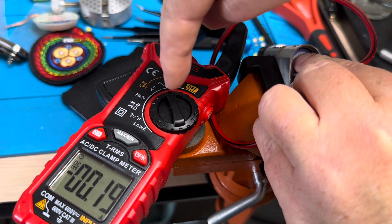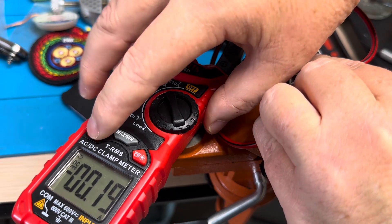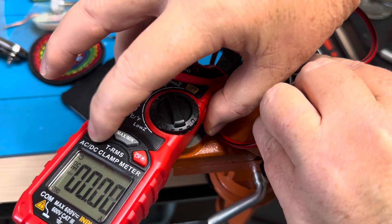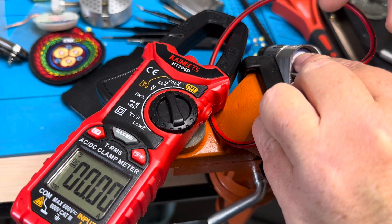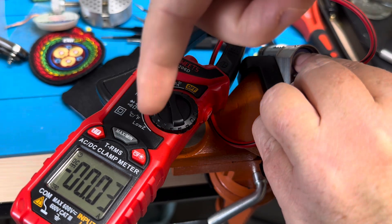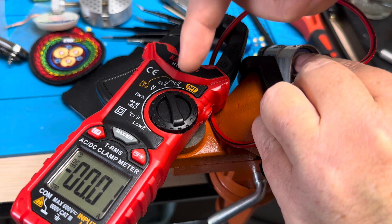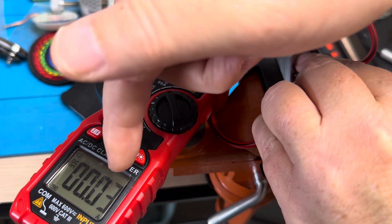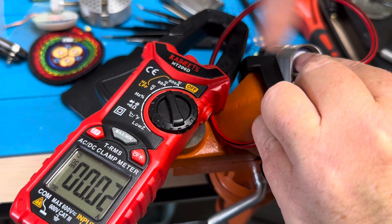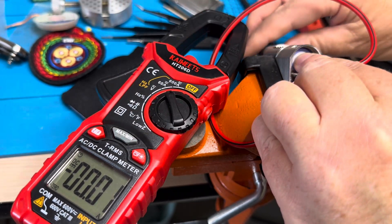So I've completed the lead and you can see it's not zeroed. On this particular meter, you press and hold the Z button. Now, people might argue there's parasitic draw because you complete the circuit but zeroed it out to zero. The parasitic draw is very low — probably not even measurable by the accuracy of this meter. Notice also it's varying — that's because this is induction, that's how it reads it, so it's going to vary. I wouldn't worry too much about it.